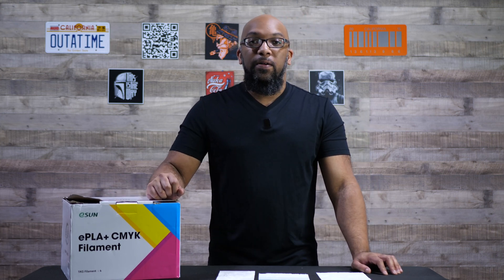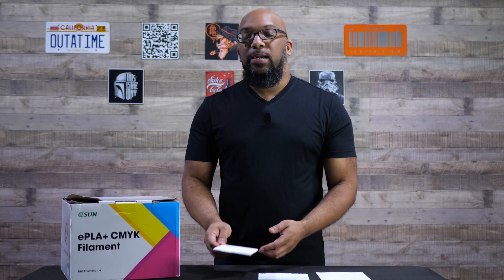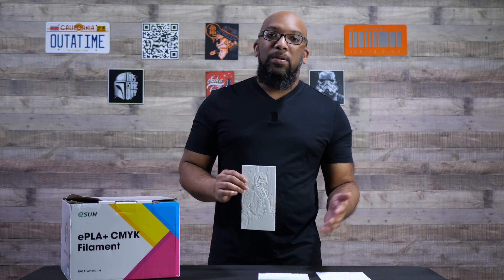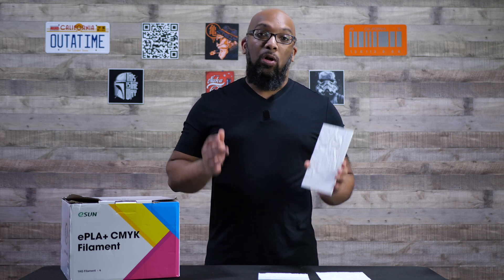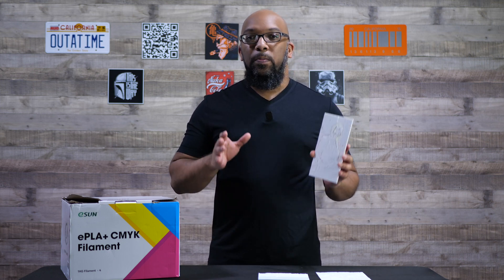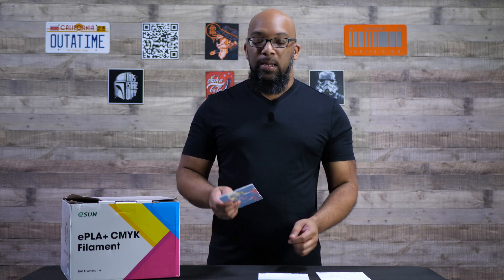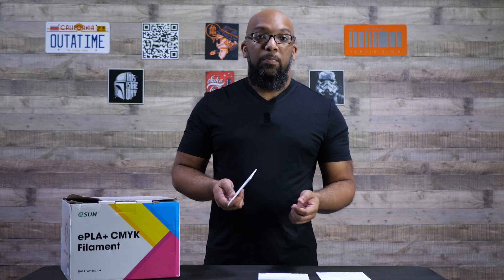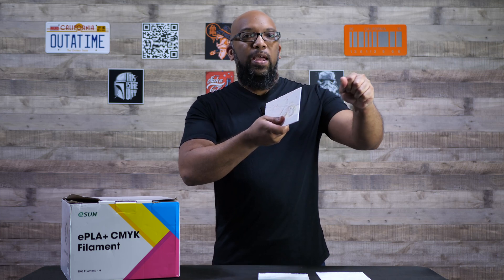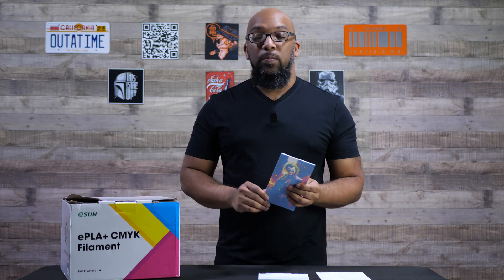Before I go, one word of advice: you can also apply an outer brim to your lithophanes. By applying that brim, you'll be able to cut down on the chances of the corners curling up during the printing process — sometimes that happens, sometimes it doesn't. Considering how long some of these lithophanes take to print, like this Joker here, I think it's a good idea to put a brim on it just to give you a little bit more security that the corners are going to stay nice and flat on the print bed. You can peel the brim off pretty easily, and any remnants left over you can get yourself a hobby knife or X-Acto knife and just cut right along the edge nice and smooth. It should be a clean cut and then you can clean up those edges.